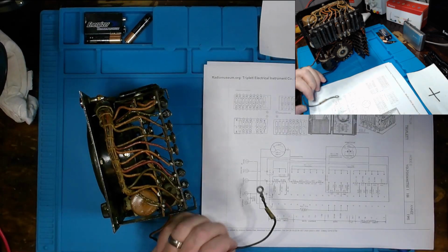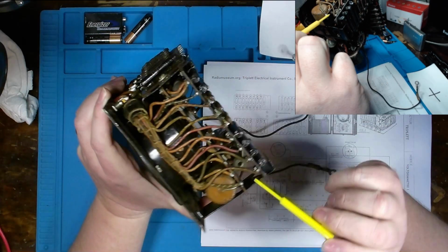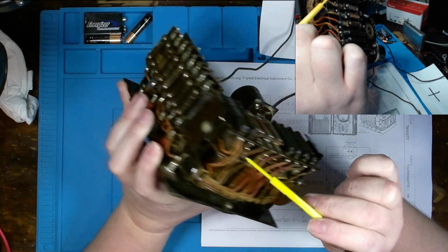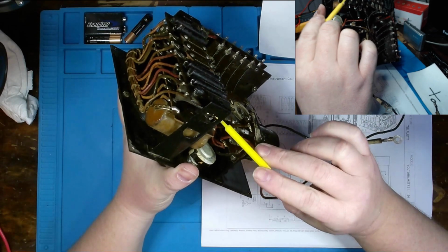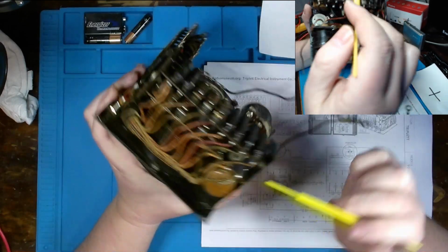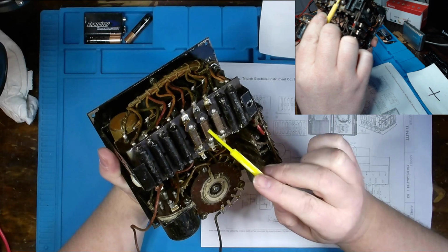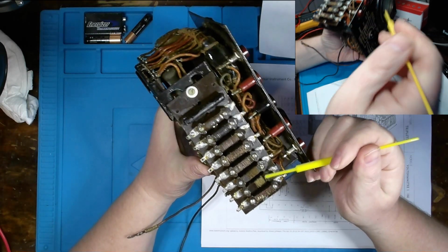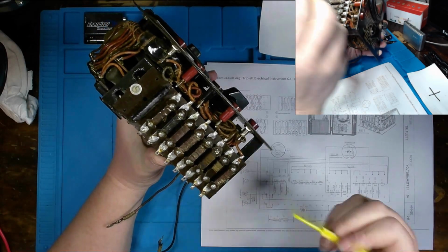But anyways, I wanted to take a closer look at our resistors here. Now these are all, if I'm not mistaken, wire wound resistors, just like what I mentioned with this bigger old school dog bone resistor here and here. Dog bone resistors, if I'm not mistaken, are going to have a pretty wide tolerance of like 20% or something like that. Whereas I assume the tolerances will be a lot tighter on these other resistors, especially the ones you see here that look like they were essentially manufactured to a specific value, because we have some very weird values on our diagram here that are awfully specific.